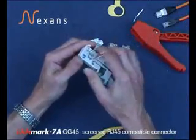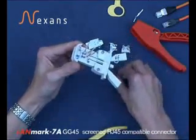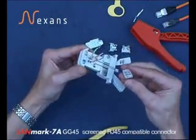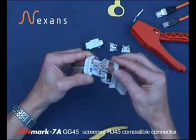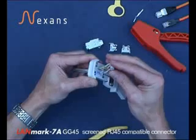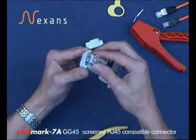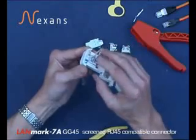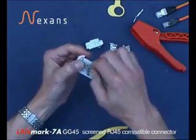Move the shutter back, draw the cable down into the tool, and we will place the wire manager over the cores following the correct colour codes, sliding it down onto the tool. Push the cable gently up inside the tool so that the foils go inside.